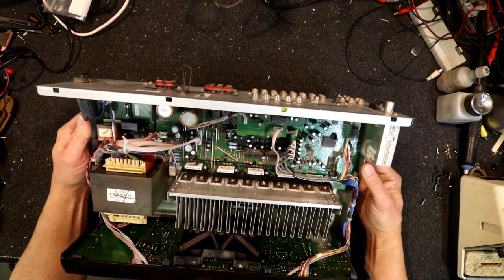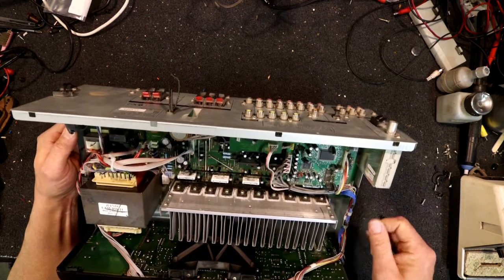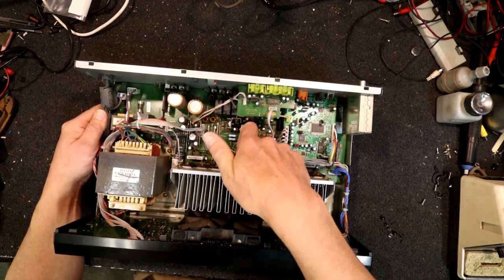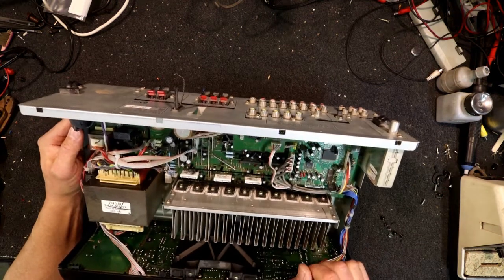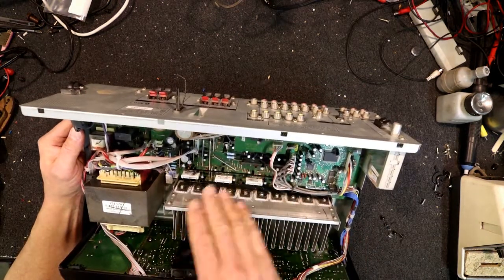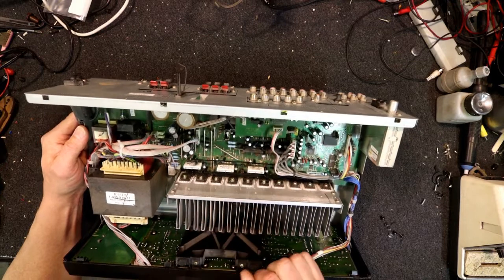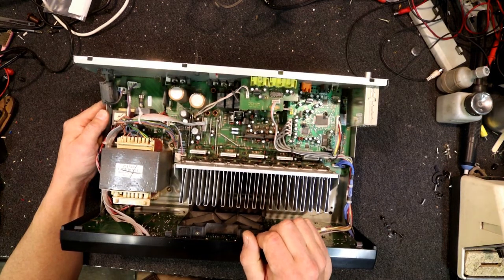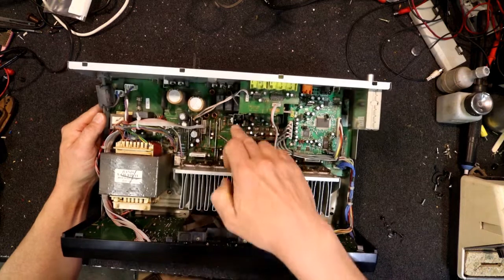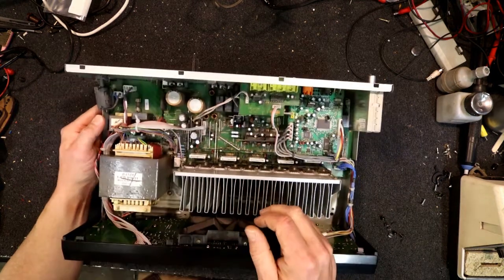It's certainly starting to show signs of having a bit of heat effect in it. We've got these pre-driver ICs here, and instead of having lots of pre-drive stages in these modern amps, they just use a couple of chips, even when they don't have chips for outputs. Originally they had lots of pre-drive transistors and output transistors, but now they've gone the other way - output transistors driven by a couple of driver chips. You can see they run pretty hot, the board's starting to discolour around them, especially these driver chips - they're often common for getting dry joints on them as well.